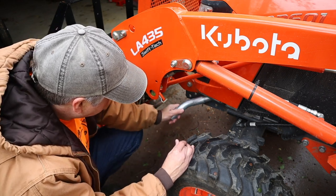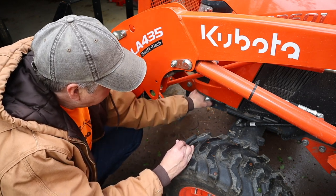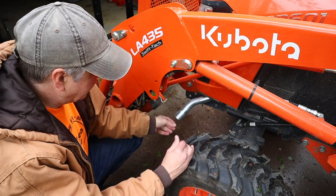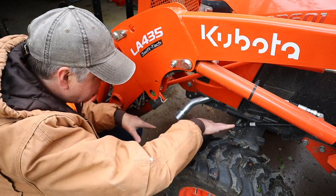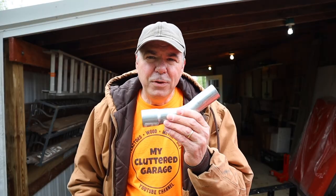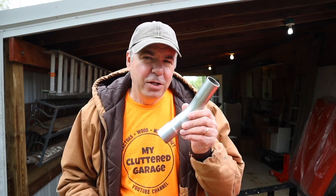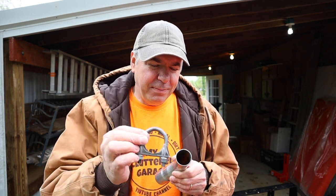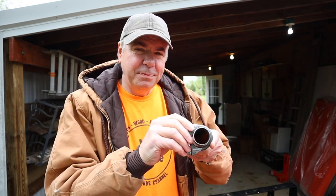So what we're going to do is mount this on here. You could just clamp it on just like that and be done — that would be fine, but I don't like the look of the flared end. If you want to use it as-is, just leave the flared end on the outside, slide this over the current exhaust tip, pick up a one and three-eighths muffler clamp — I'll put a link in the description — slide that over and tighten it down. But I'm going to do something different.